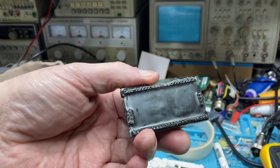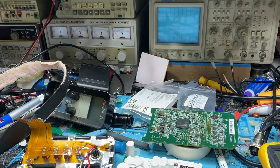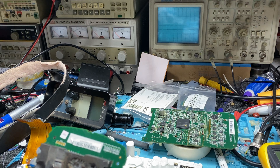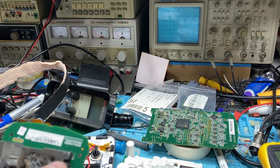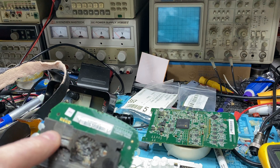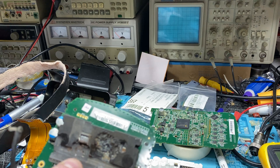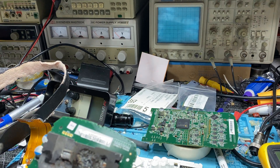Okay, here's the module. Failure number one, apart from people blowing them up by sticking ill-fitted dongles or two other coils — but this gadget here, you can have a look. That's where it lives, in there. This thing is basically fried. I actually heated it up and had a bit of a dig into it. You can disintegrate this material — the plastic, or it might be a resin, I don't really know. I always thought, what the hell is this thing? It looks like a big lump — it actually looks like a polypropylene capacitor. There are round ones and square ones. That's what it was, and that's where it burns out. It all bubbles and pops and gets through and pops out.